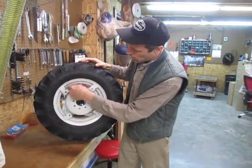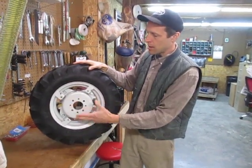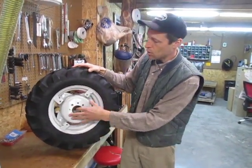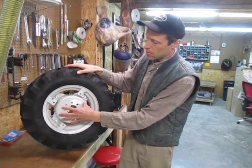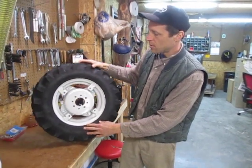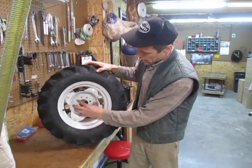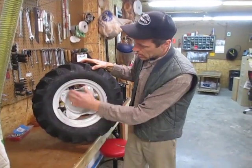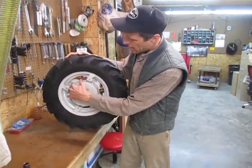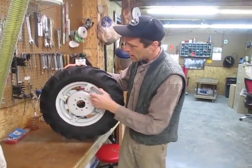It's secured together by four nuts and bolts. The shape and size of this inner rim, outer hub, and these brackets change slightly from wheel to wheel size and brand to brand. This is a Grillo wheel. Sometimes we use these wheels on the BCS depending on the application and whether it's an air-filled or foam-filled tire. The inner hub and the outer rim are two separate pieces linked together by these bolts, and you've got two separate sets of brackets. There's a set of brackets here and a set here that this one is already bolted to, so this inner hub could be bolted on in either place.